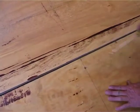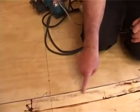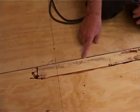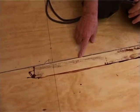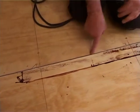That's about the 5mm. You'll notice that we've left a little 5mm gap between the boards. This is also for expansion purposes. It's a full big board, at least it's got a little bit of space to move into. If it was tight and did expand, there's a possibility it could push itself up. So we always leave a 5mm gap all around on the boards for expansion.